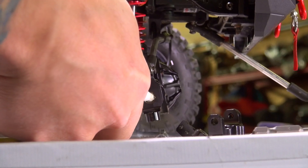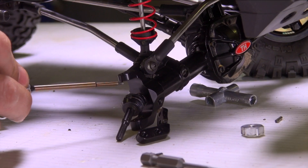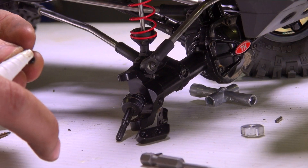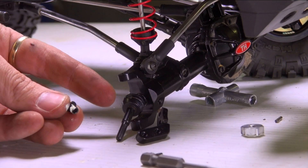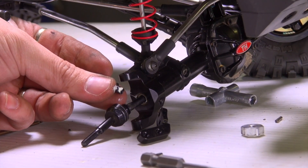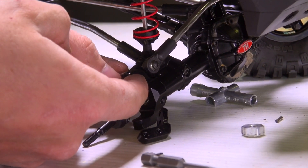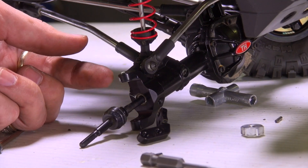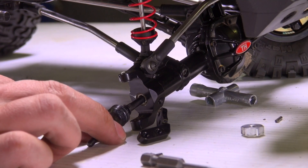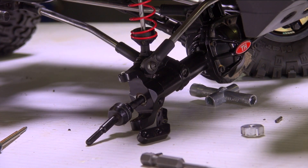Just gonna put some grease through so the bearing gets some protection. Right here on top I'm gonna be adding a collar, and the collar is to actually help everything swivel. But because it's on top, it's a little bit of a challenge because it could keep falling out easily. So I added a little bit of grease — you can see using a nice white color so you can see it easily. Gonna pop that in, and that grease is actually gonna hold it in spot for you. If you're having a little bit of a hard time, I've shown this trick before, but so many people comment that this actually helps them.